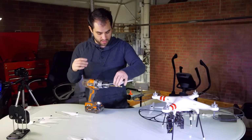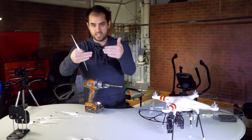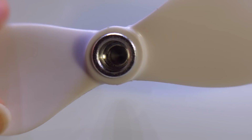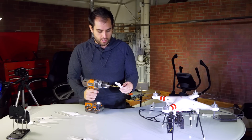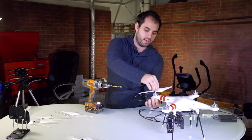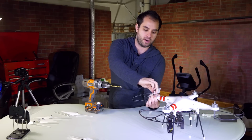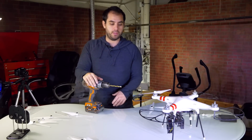And there you can see some shavings on the table. You don't have to worry about hurting the threads because it gets much thinner before it gets to the threads, and your tip won't let you go that far unless you're forcing it. Again, just hold it very gently, go slowly, and let it clean that surface off. Once you've done that, you'll see that it'll be like a normal propeller, and it'll go in there all the way and be seated fine. That fixes that problem.